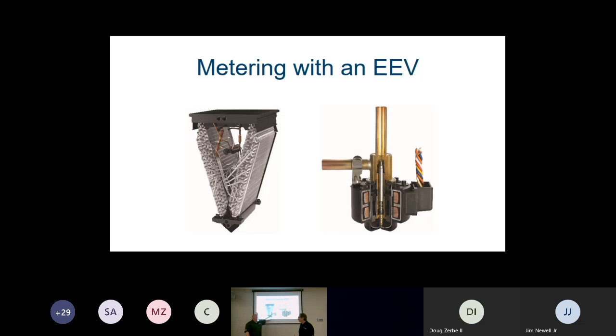Again, just as a reminder, when we charge with an EEV, we're going to charge to subcooling. Correct. And with that, I will say this: you should be able to get a nitrogen flow through that. That's oftentimes a question that guys will ask. The valve is not going to be in a 100% closed position. We should get some leakage. It's going to be slow, but you should be able to get some leakage through. If there's ever concern, guys, you can always pop the stepper motor off, take the black body off of that valve that you see to the right on your screen, and you can take a pickup tool magnet if you need to, run it around the body, and manually open up that valve. Or if you power it up on the board, you can go to test to open and then pull the stepper motor or kill the power at that point, and you'll hear the nitrogen rush through.